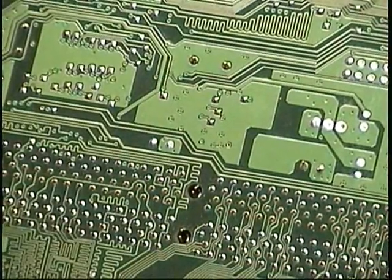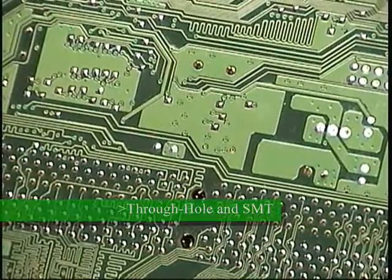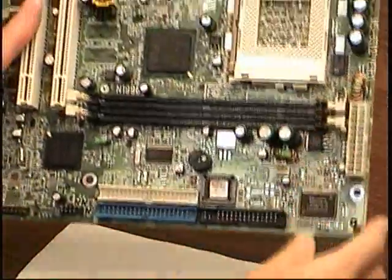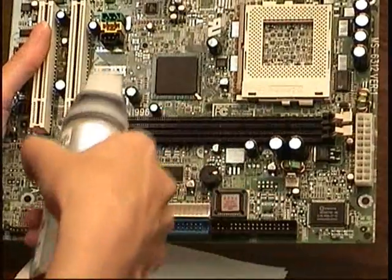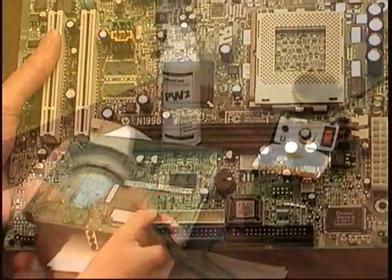One of the many advantages of the trigger grip is its versatility. It works with both through-hole and SMT components on RMA, no-clean, and lead-free fluxes. It's effective for rework and repair both on the manufacturing line as well as on boards that are returned from the field. The trigger grip provides a pristine surface for soldering both before and after rework.